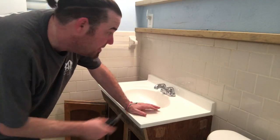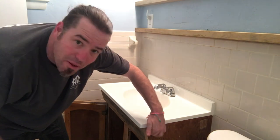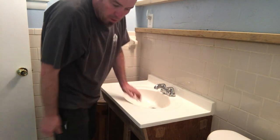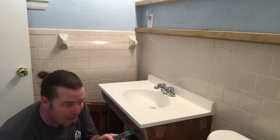Now we're ready to free up the top from the wall. Go ahead and cut the caulk line and then see if there's anything else — maybe it's caulked to the cabinet. After the caulk is cut you can lift off. Now it's lifting the whole vanity but still not coming up. These usually can be caulked down or liquid nailed so you might be dealing with that.